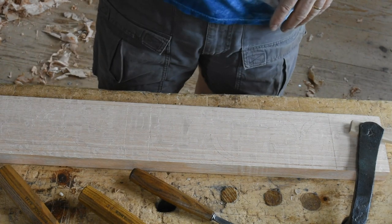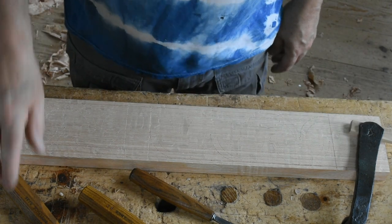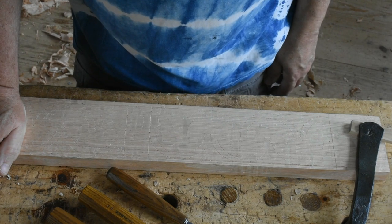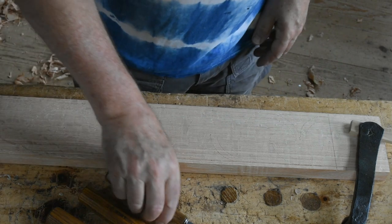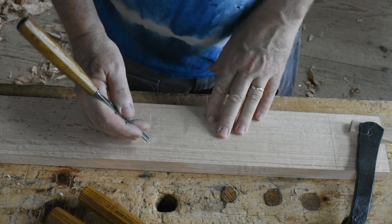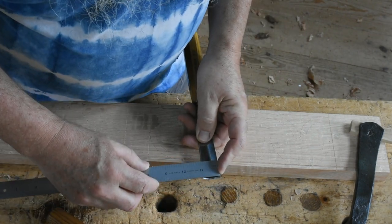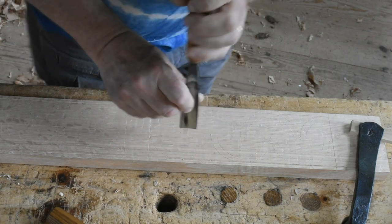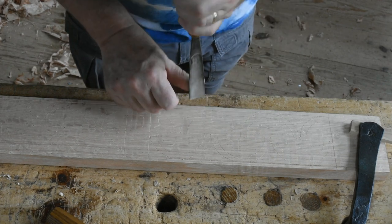I picked out a few different tools to try to outline just the arcs, and just the outside of the arcs to begin with. And these are three modern carving tools of the Swiss Made company, and they are all number fives. And you could use any one of these to do it. The narrow one, you'd be nibbling along, making a lot of cuts, and each one has to sort of overlap its predecessor and be kind of a choppy result. So the narrow one is out. This one is, I think, an inch wide, nearly so, and it's a pretty good one. Again, it'd take a few strikes to march along that circle there. Well, if I did it down here, you might see better what I'm looking at. So just trying to see how it works along those lines.